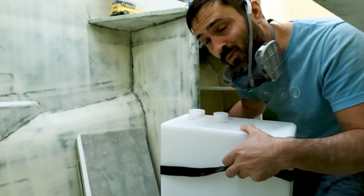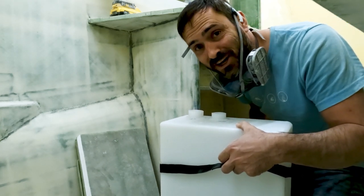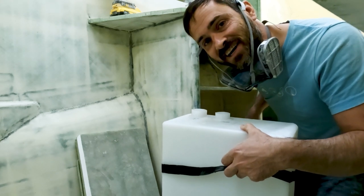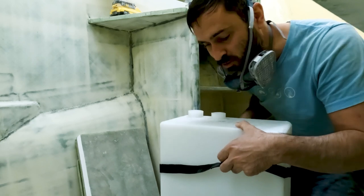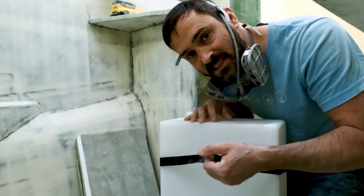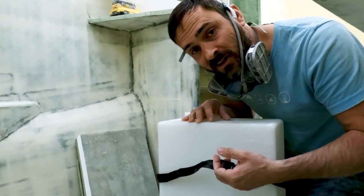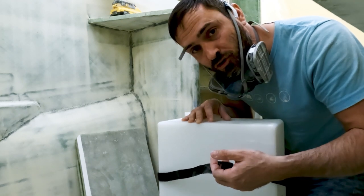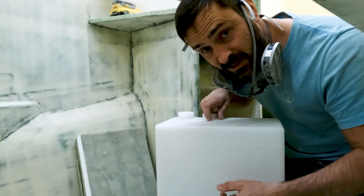Now, one side of this is through the hull, which would, of course, not be the way to do it. And then the other side is through into the shower area, which just for cosmetic purposes, we don't want through bolted. So this is something done before, just glassing these things into place, and works really well. Just two little strips of fiberglass, a kind of vertical setup, and they hold these things really well. And will hold, hopefully, the tank really well too.